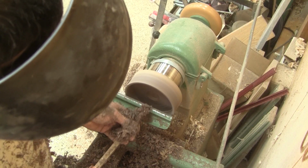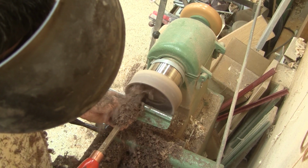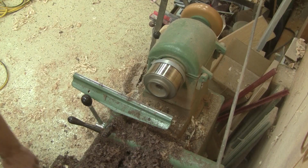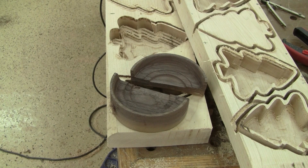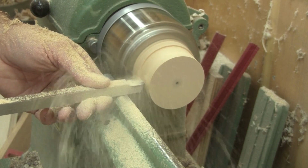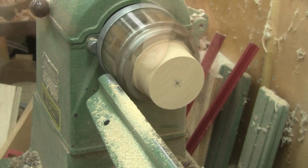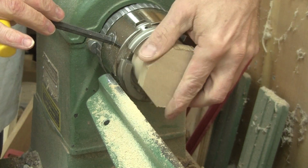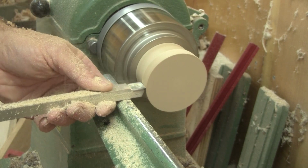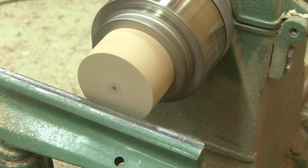But I wanted even more bowls. Oops, one less. I just need to turn another one. I also turned small boxes with a lid on top. So after turning a cylinder almost all the way, I turn it around and finish it. Clean the interior and apply a coat of wax.